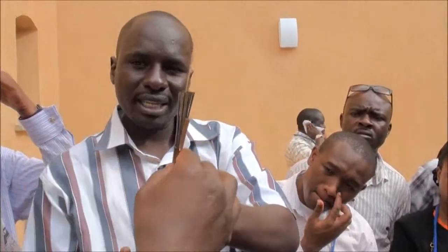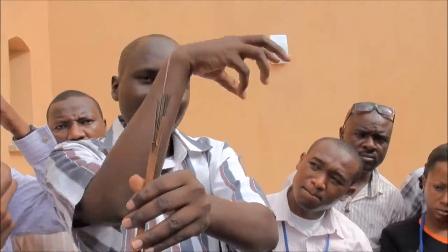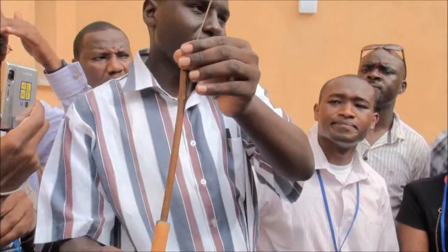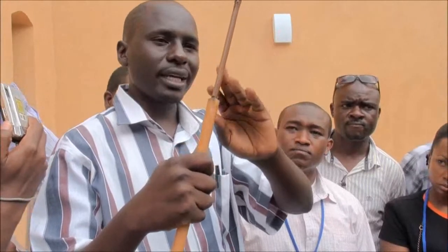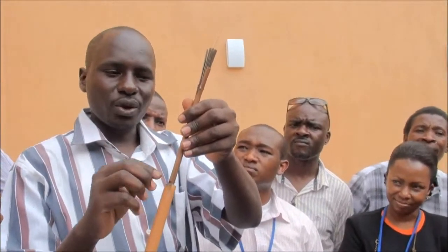The negative cable is used as the ground cable. The amplifier has a metallic casing, so when it is dropped into the sea, it makes contact with the sea. Here at the station, we have dug deep and dropped a cable so that it can be a continuous return path. So we are only sending one conductor into the sea — the positive. This one can carry a maximum of 5,000 volts. So in case someone wants to cut this cable, they'll have to deal with the power first — and the power will deal with them, especially in the water, where they become conductors themselves.